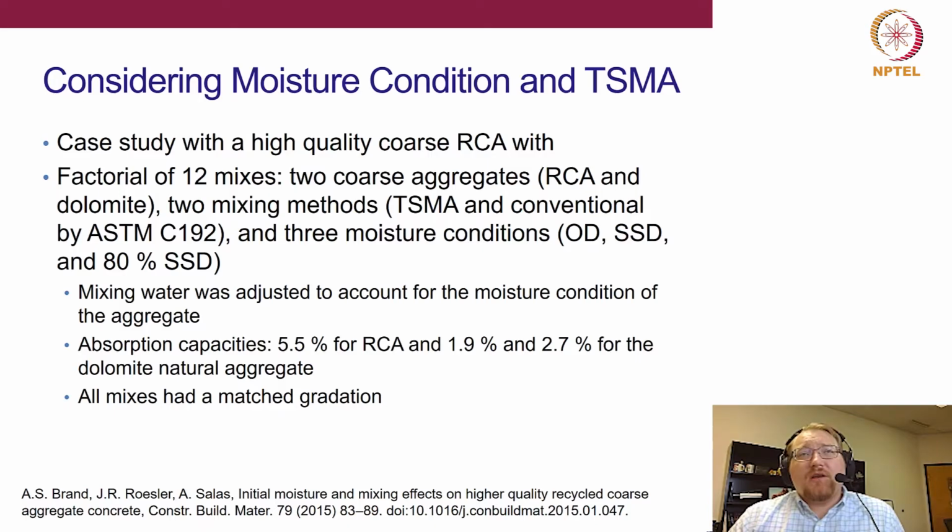It was part of an airport that was pretty much relaying out all of its runways. It was demolishing its existing runway directions and paving new ones and longer ones. So the concrete in that case was not necessarily damaged. It was still high quality, right? It had to meet strict regulations for the FAA. So we know this was a fairly high quality RCA, didn't have durability issues, so we expected it should perform well.